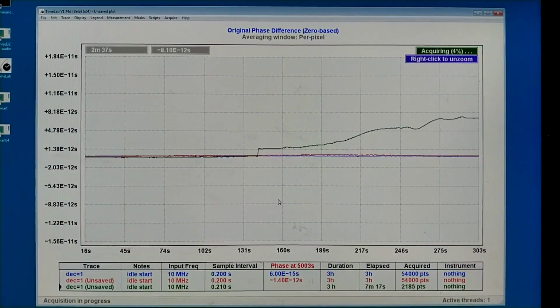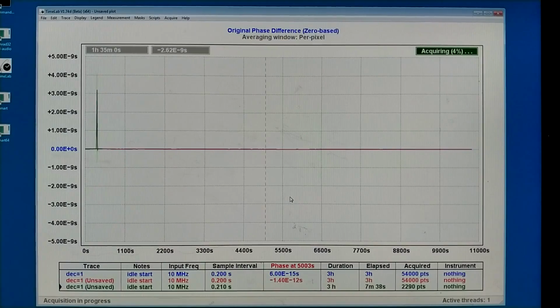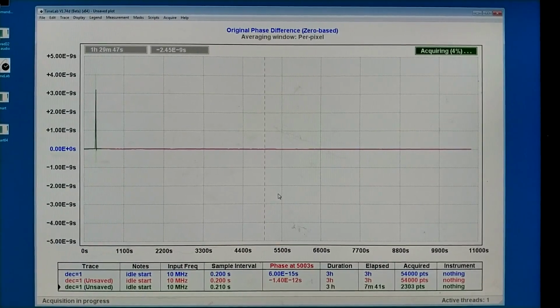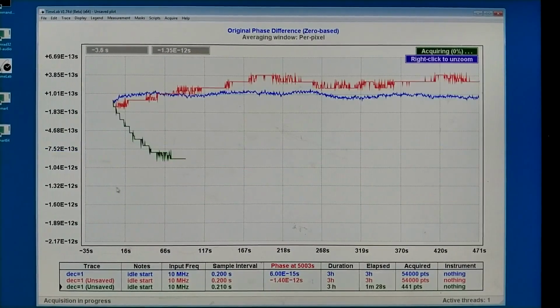When I zoom into the region before I came close to those thin cables, here you can see what happened when I was heating the RG223 cables. I zoom out, it looks like this, and I will remove this and start again. As expected, the phase is drifting rapidly now. I can zoom into this region. But I expect it to be flat fairly soon now.